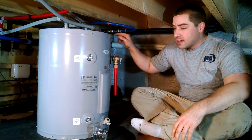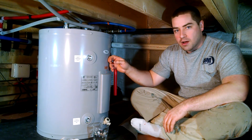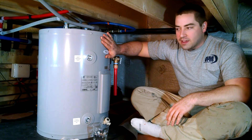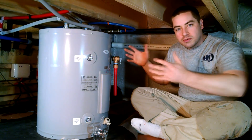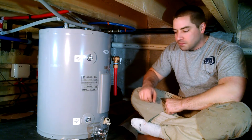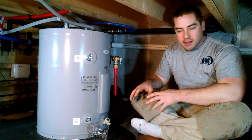Actually not today — the tank is at a hundred degrees and the solar tank is at 130 today, so this guy should be off. Except it has a standby loss. It's not a very well insulated tank, so all these components coming off of here get hot and they're losing heat to the surrounding environment, which means the electric element has to keep kicking on. So we're going to insulate this guy today to cut down on the standby loss.